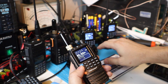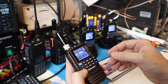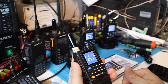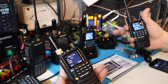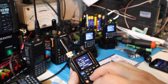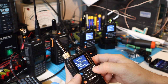It also has another mode if others get confused about which channel they're on or you want to simplify dual monitoring — that's sync, menu item 36. If you turn that off it goes down to one channel it listens to and transmits on, and either push-to-talk button works. There's also a scan-and-save mode where you press and hold number one — it listens for another person transmitting, finds the frequency and any code. Then you know the frequency they're on. This works outside of GMRS too, so it's a bit of a frequency counter. You store it and you're off to the races.